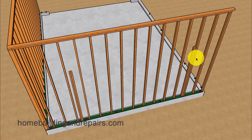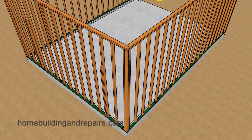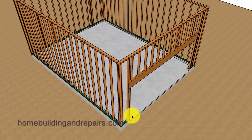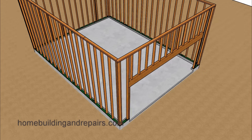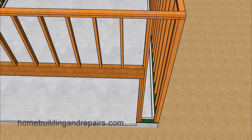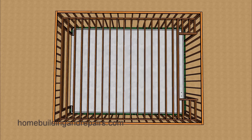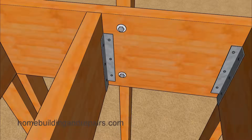We are going to have a couple of support boards here for our floor framing. I made this garage 24 feet long and 20 feet wide. The reason for that is we're going to put the stairway in the back, and you'll still have room to park a car — a 20-foot space. Let's go ahead and throw the floor framing in. These will be 2x12 joists for this project; however, there is no guarantee that will work on your project, so keep in mind I'm only providing examples.